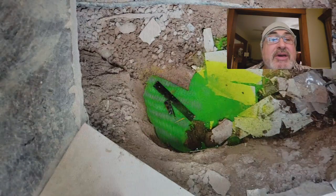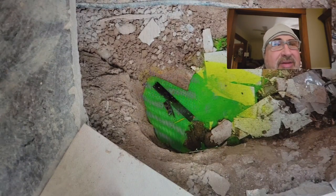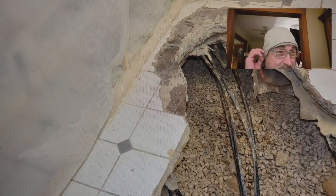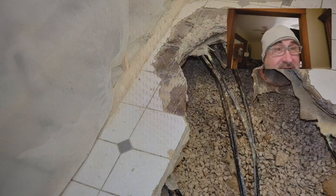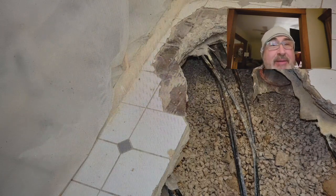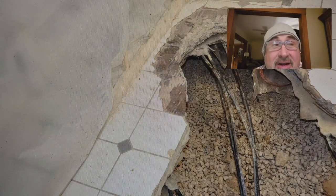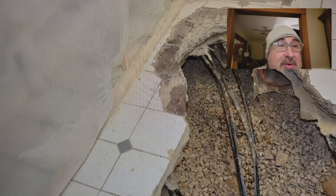Here you can see we're starting a tunnel. Another thing you can do if your guy's good — he'll use dye testing to find out where the water's going and where they're broken. Your workers have got to know what they're doing. They're going to jackhammer. First you cut it — you get a saw cut with water, otherwise you're going to create dust. You've got a saw cut, then a jackhammer, and dust. And you've got to be careful about all the pipes, plumbing, electrical, and conduits that are underneath.